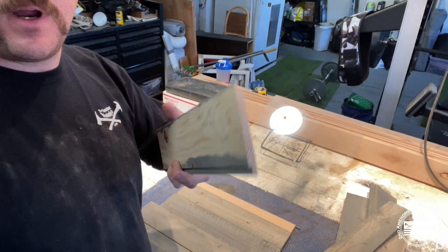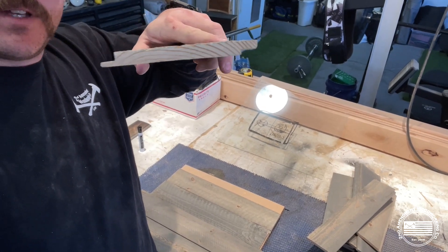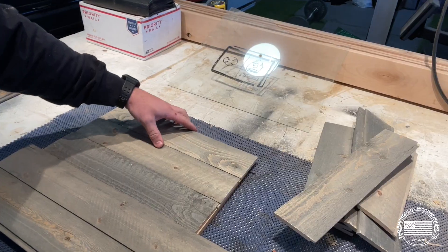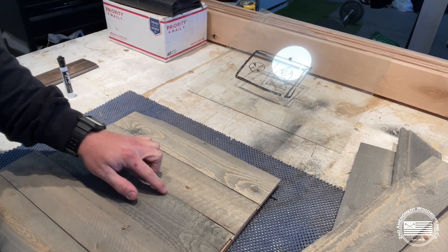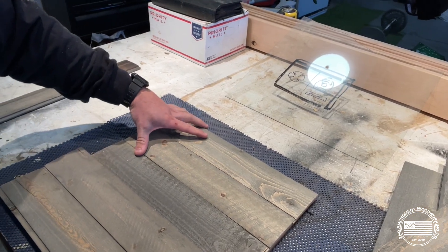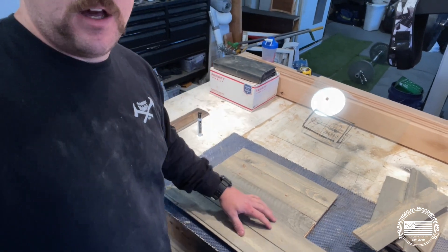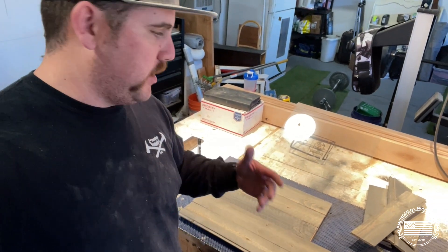The plan is I have some shiplap left over from another project and I'm going to utilize it. Shiplap has two shelves on each side — half of the thickness of the wood. Each piece nicely lays into each other and you get good seams. I can either brad nail, tack, or do whatever into the seams to lock these together. Basically I'm just going to cut all these down to the thickness of my backer, which is that MDF. Once I have a good solid base I'll be able to build off of that.